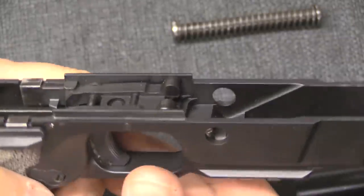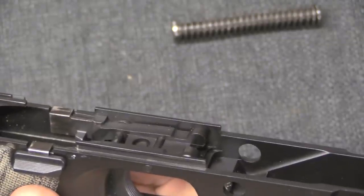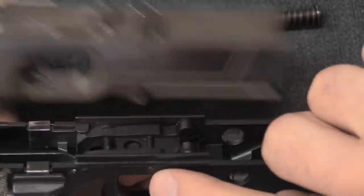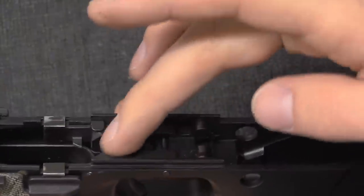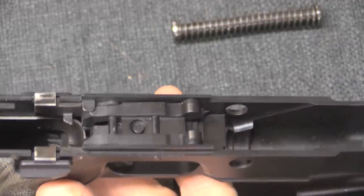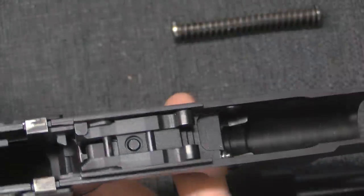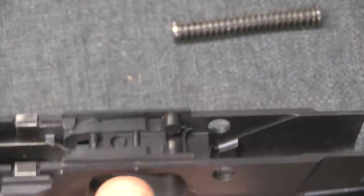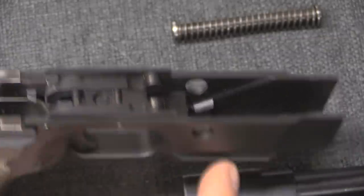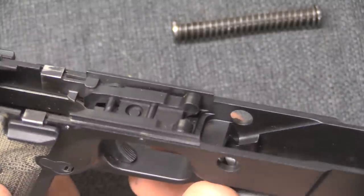Pull out the barrel - you still have the round locking lugs in this one. There's the brick barrel and the boat anchor barrel. This actually looks like pretty much the same design, just got away from the oversized barrel wall. I'm surprised you still have the rounded locking lugs - I thought that was virtually impossible to manufacture. We had an iterative step here - this is actually the beginning of our adoption of an insert chassis. These lugs were machined as a separate piece and then pinned in. That was still very complicated - we used a circular piece as reference. But at this point it's something you can actually manufacture, even if expensive and difficult, and it's not integral to the frame.